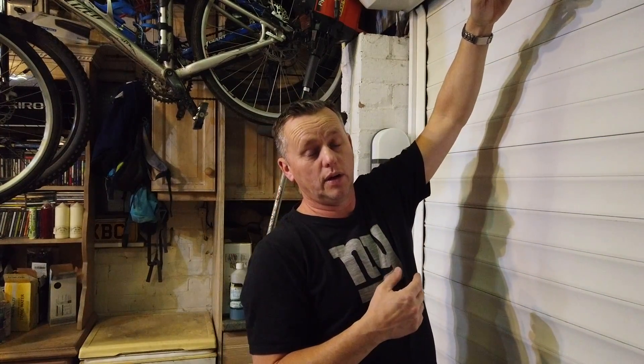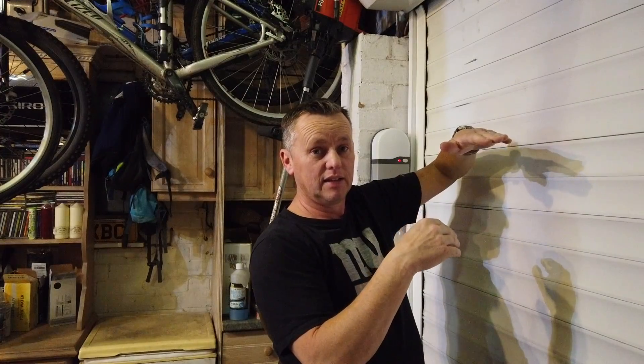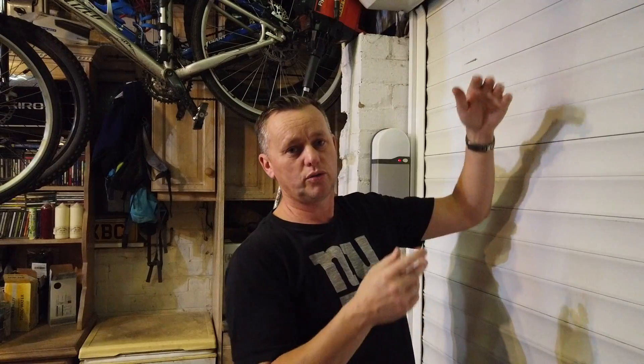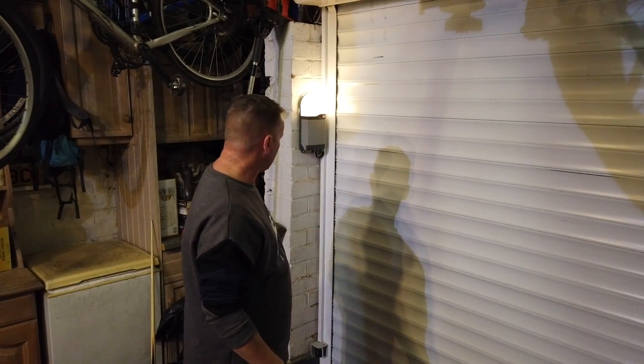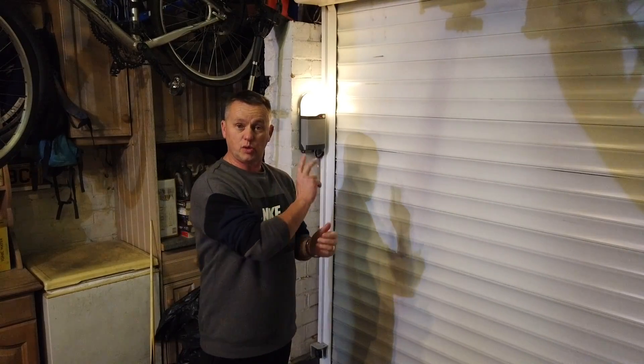In this internal garage, if the car is sticking half out I want to bring the door down to keep the heat in - and obviously if the car's in the way the door won't come down. You've got to be a bit mindful if you've got children running about - then the photo cell is probably a necessity - but for me I don't need it; use a bit of common sense and control the door yourself. So there we go, door operational. The unit's been repaired, we've replaced the board, everything's as good as gold. If you're having troubles with one of these or a similar control panel, at least we now know how to check it, how to override it, or how to replace and repair it. Thanks for watching.